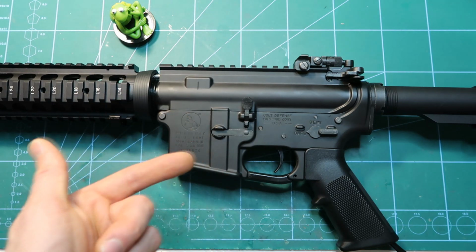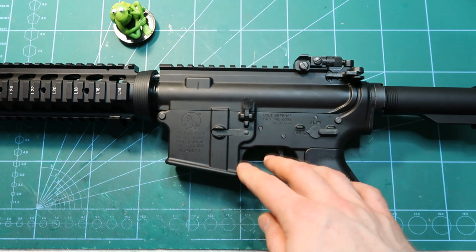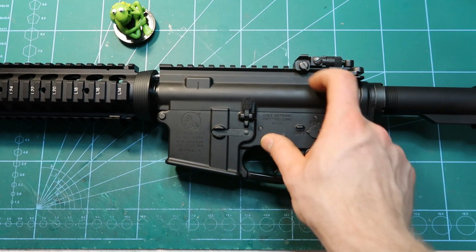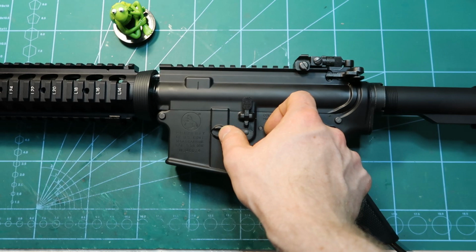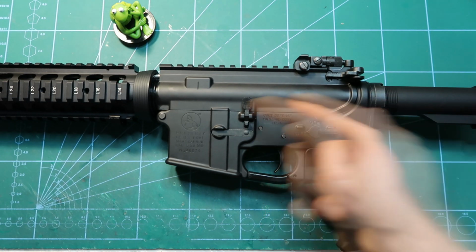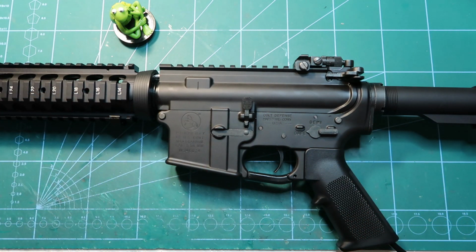The initial force from the springs and so on is a little bigger, so it pushes the valve just a bit, but then the pressure pushes it back and there is no shot. So if it happens in your case, you need to take this valve pusher part that is assembled in the conversion, the part of the conversion I mean, and just shorten it like 0.1, 0.3 millimeters, because then the hammer, when traveling, will strike the valve knocker, this will strike that valve pusher part, but it will take a little more time, there will be a little more travel for those parts, and they will gain more momentum when traveling, and they will have enough strength to push this valve completely. So in case you have dry farting issue, that could be a solution.